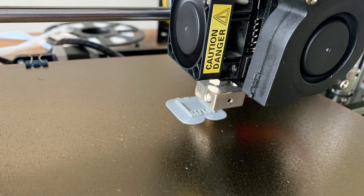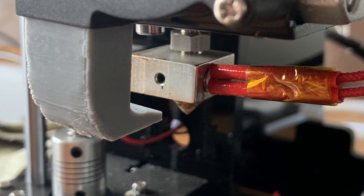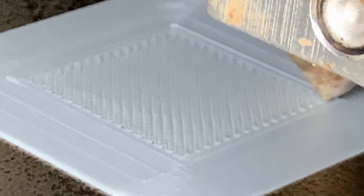Another issue I found on this 3D printer was that the 5015 parts cooling fan didn't have any fan duct. I went to Thingiverse and looked for one that could fit the Anet A6. There were so many mods and different fan ducts, so I took one that was way too long. In Cura I re-sliced the parts cooling fan duct, scaling it down on the Z-axis only — not X or Y — to around 22–25 millimeters. We printed it, test-fitted it, and it fits nicely with no glue needed.